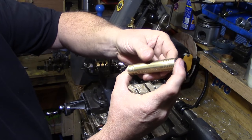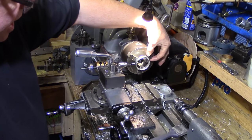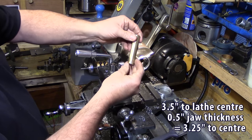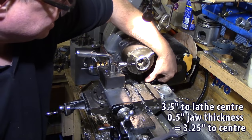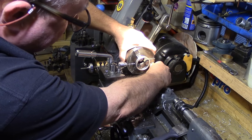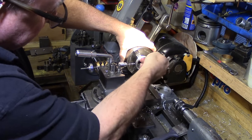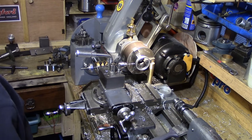What I've come up with is basically just a brass bar turned down to exactly 3¼ inches. My lathe is 3½ inches and the chuck jaws are half an inch, so 3¼ inches brings me to the center of the jaw. I simply pop this spacer down on the bed of the lathe and rotate the chuck around so it holds firmly, and I know this jaw is parallel to the drill.